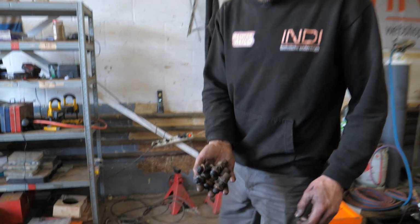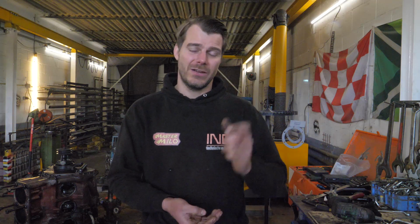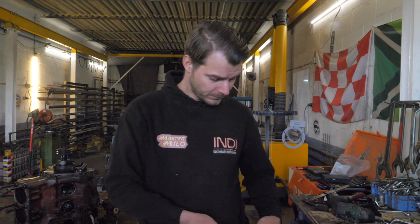Because we have everything disassembled now, we want to check the valves one by one. What we find out is that some of them are badly rusted, corroded, and some of them are stuck. So we free them up, and the rusted ones we can exchange with the spare ones we have of the Type 69. Lucky enough, BMP and T55 have the same starter check valve, so you can just exchange them. So that's a good thing to know.